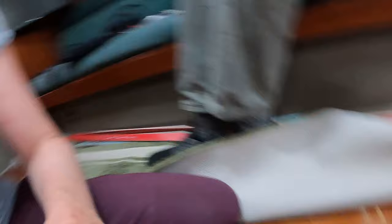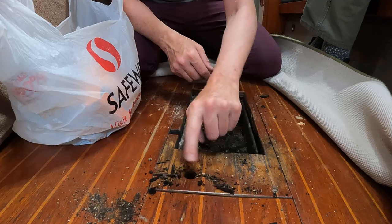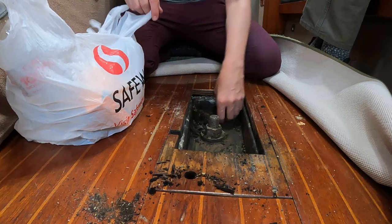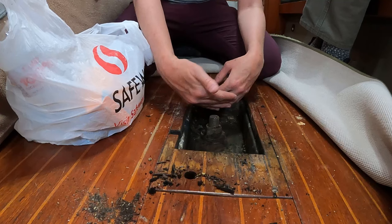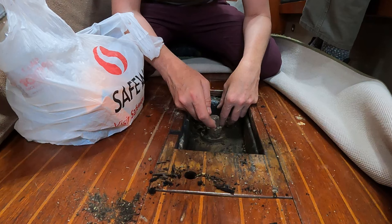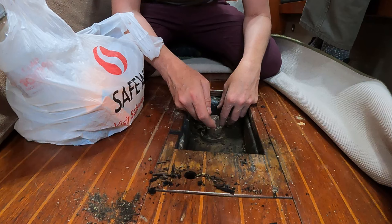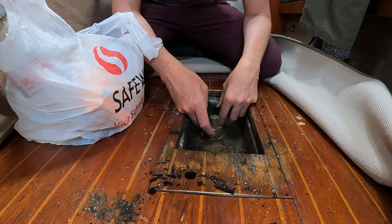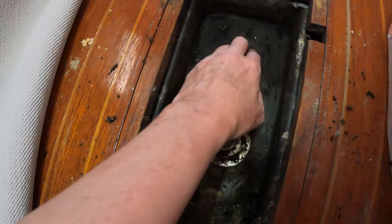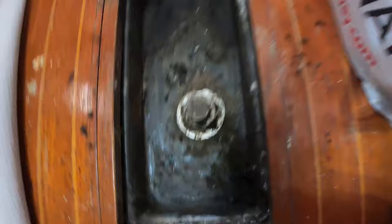Fair to say these blocks have no life. I want to get a good look at this - it's literally mud down here. The keel bolt still looks perfectly fine. I could probably plant flowers in this. I think I might have absolutely won the lottery. When I was at Annapolis Riggers he showed me one of these that had been completely corroded and it actually snapped when he lifted it. With this keel bolt here, there's no way to get the mast step out without pulling this keel bolt. This keel bolt is something like 300 foot-pounds of torque to tighten it up and I don't have a torque wrench that big - I might have an excuse to buy another tool. I'm not seeing any signs that the aluminum has corroded or bubbled - this is looking totally fine. I don't play the lottery but apparently somehow I won anyway.